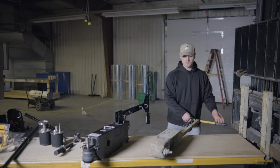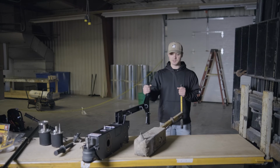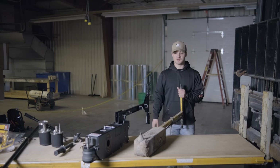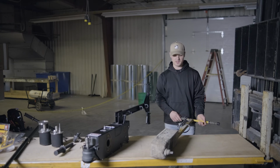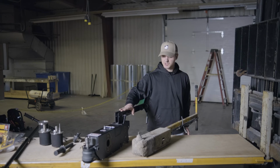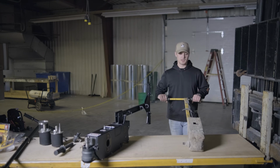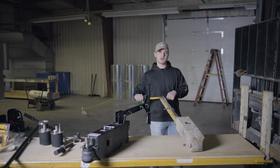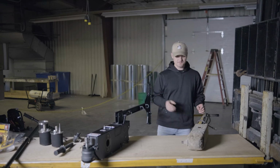It's corded, but comparing to this one, we don't have a kickstand, right? So we can't set this down to go grab something real quick, we have to lay this down on the concrete, hence all the concrete covering this tool. Another thing that this one doesn't have is our adjustment. So if we're up tight against a wall, say we're up against a wall right here, and we're trying to pull our screed, we have to stand away because I can't stand in the wall. I'm binding up the pipe. So I don't have the flexibility as we do with that one.